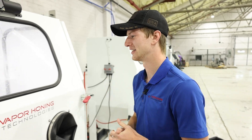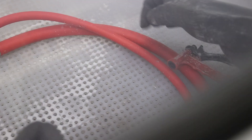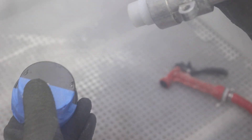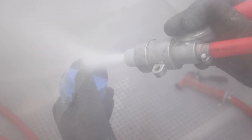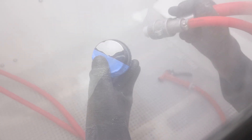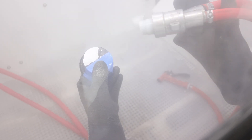We're going to go ahead and get blasting. I've got the tape on here and the foot pedal in the right spot. Go ahead and begin blasting. This is glass bead — we're going to be blasting at 100 PSI just to see what this thing can really do. That's crazy. That was just seconds. You can probably see it peeling away on video.